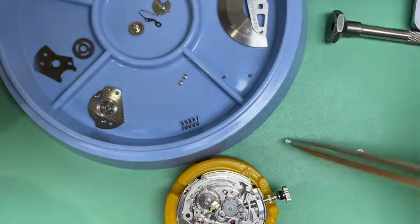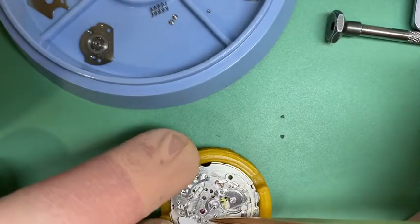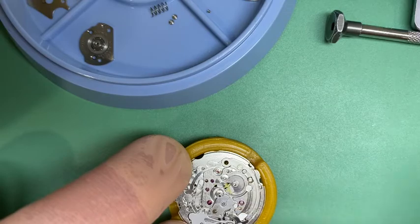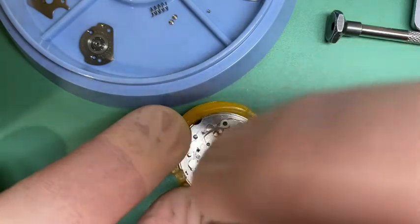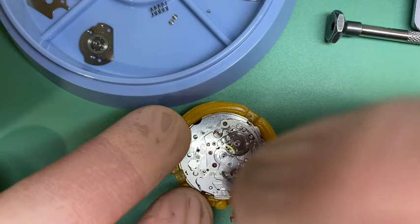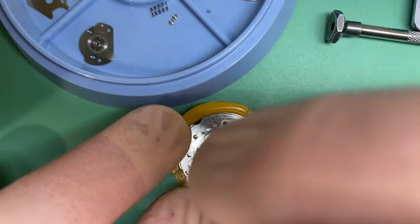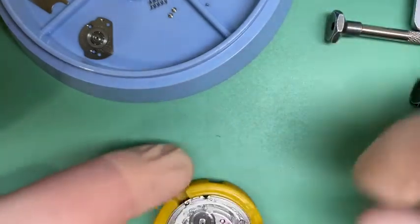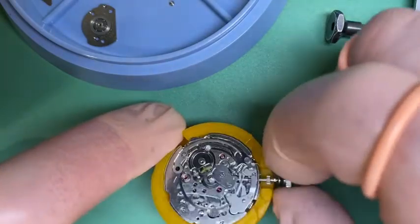Now this we use a flat screw and a sunken head screw. We put our sunken screw in there and our flat screw in there like so. Now there's no steady pin here, so screw them down, both loose, just before, and then help them find their own kind of section and then screw them both down together. And we can check, and we should have nice resistance for our cannon pinion. We don't want too much resistance, we don't want too little resistance so that it slips. We just want the right amount, and that is the right amount.